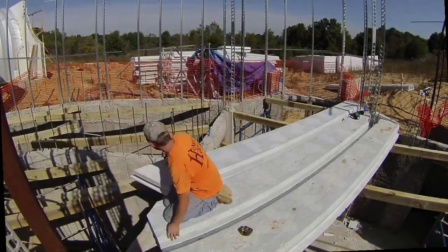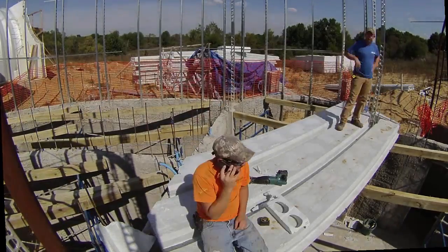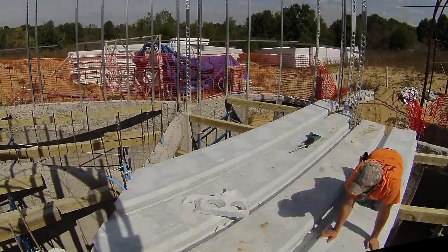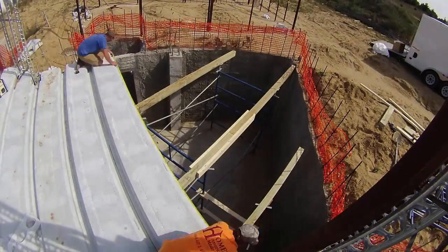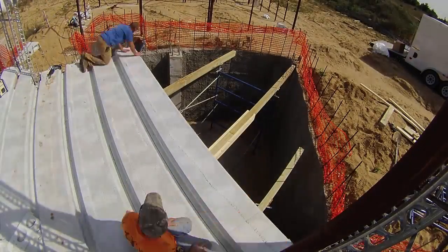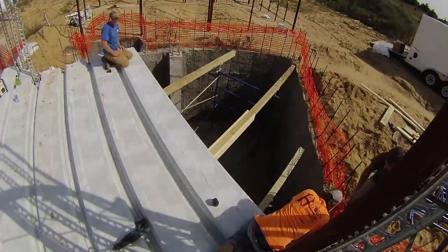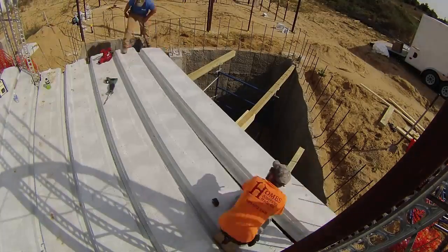The second day, they started adding the actual quad-deck material. These pieces were cut to length at the factory, but still required a lot of trimming to get the actual shape required — they mostly used a measuring tape and a sawzall. Once placed, Dan would push the new piece up against the previous and Brian would run downstairs and screw it into place from below, toenail-style, through the beams and into the steel reinforcement. This keeps the boards tightly together so the force of the concrete can't separate them.